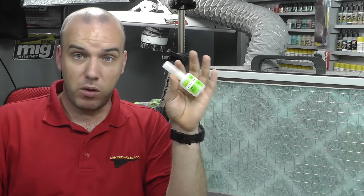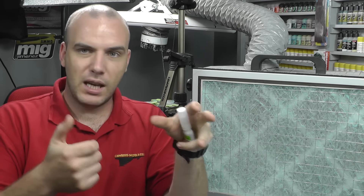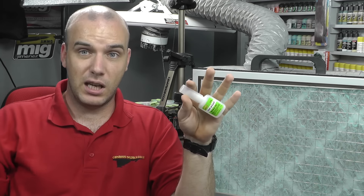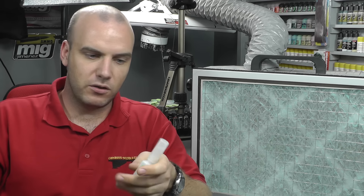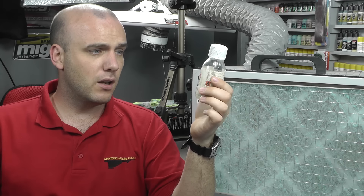CA glue super glue can also be a bit potent. More so when you use a lighter to burn off CA glue from an applicator — I read that what it burns off can be really dangerous chemicals, possibly arsenic or something. Whatever it burns off is quite potent, so you don't want to be burning lots of it in a non-ventilated room without a respirator. We've also got cellulose thinners used for all sorts of techniques — this is pretty potent and highly flammable.